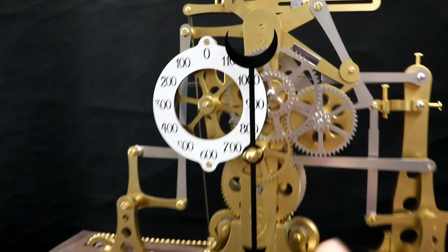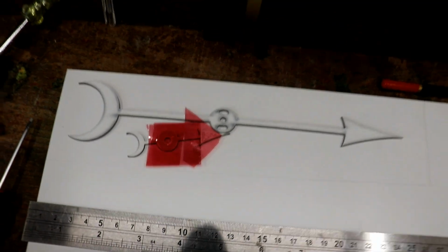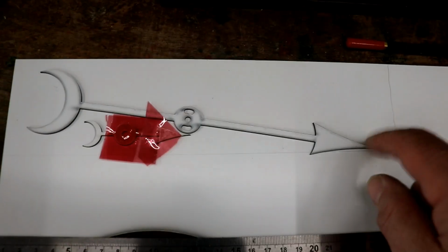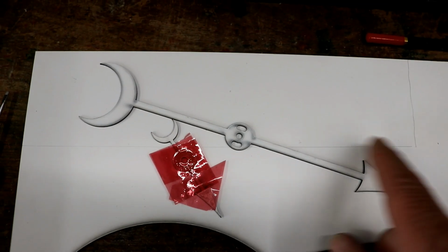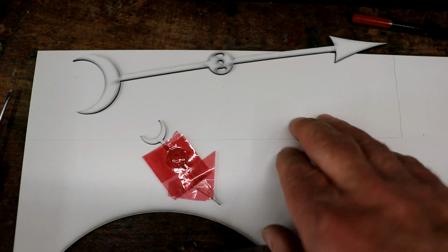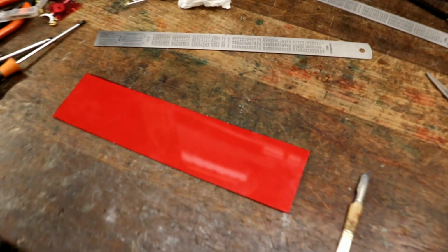So my next project, as it's all going swimmingly, is to do the pointers. So I've marked out on this laser engraving laminate, which I seem to have a problem saying today, the area. I'm going to stick two or three layers of the film over it, trying to remove all air bubbles and everything, and then cut them out in one go on the laser cutter. Fingers crossed. Well, if you don't look too closely, that's not too shabby.